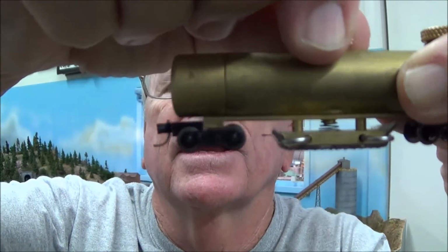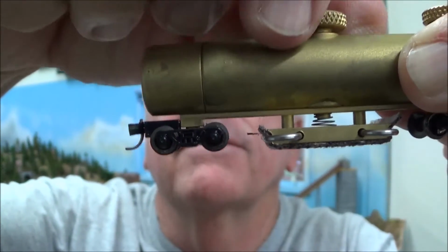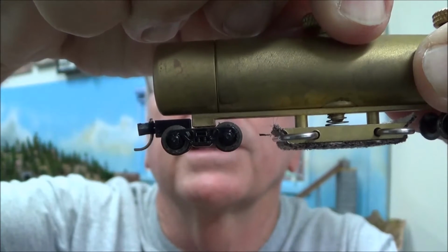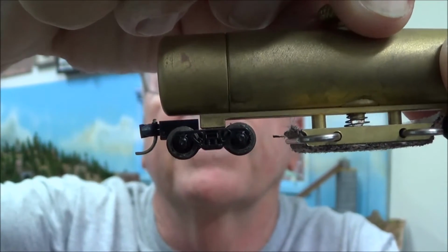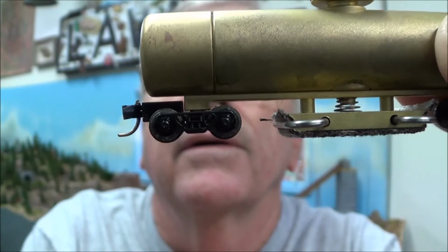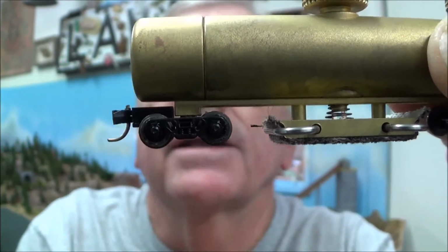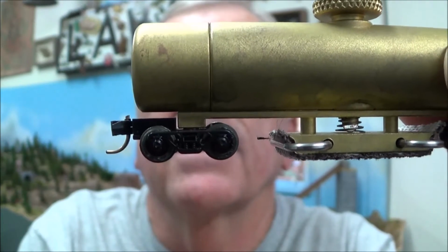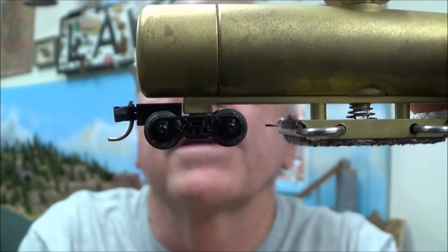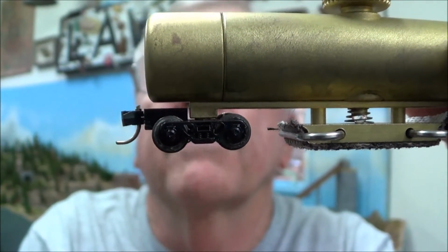That allows you to take the needle and adjust. You adjust the needle open, and by the way, you also close this needle when you're storing. Now you can see the alcohol starting to drip. Now you see it's going to drip again. I like to adjust it just about like that, where you get a drip every second or two, or maybe a little slower than that, whatever you prefer.